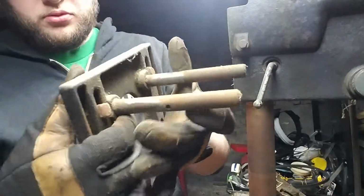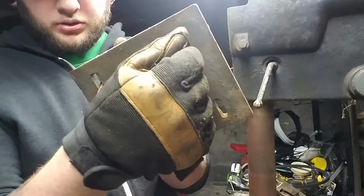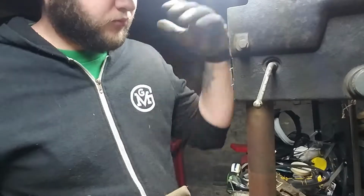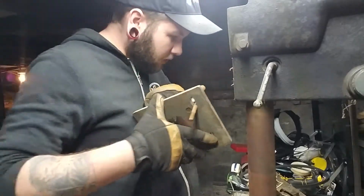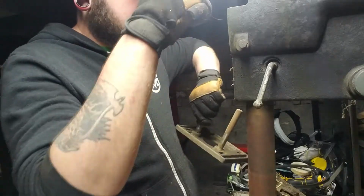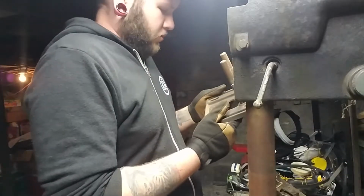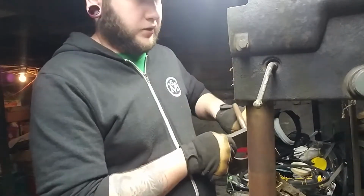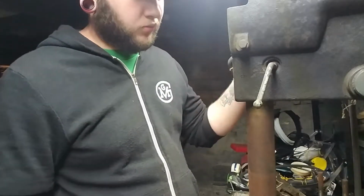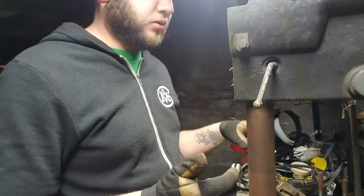So our motor bolts here. It slides out to tension the belt. There's also slots here, so we can move the motor up and down to properly align the belt. For the most part, if we get it fairly close to center on one of the middle two pulleys, we should be good for the other ones. Or you can readjust it every time you slide up and down for the pulley. But usually you have enough play that it'll work just fine wherever you put it.